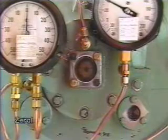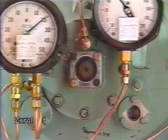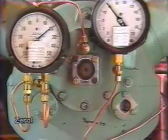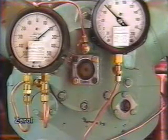This time we opened the valve quickly and didn't hurt the compressor. Now we'll close the suction service valve again, throttling down to about zero PSI.